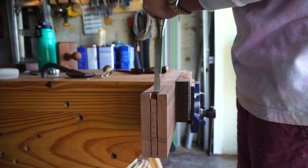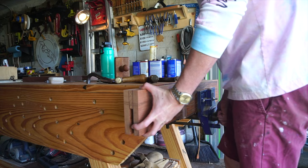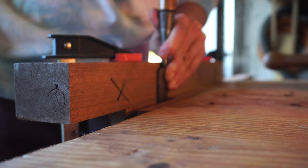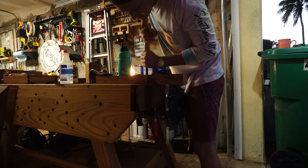To clear the waste from the mortise I'm using a half-inch mortise chisel. Mortise chisels are heftier for a multitude of reasons — namely to resist twisting and bending, with its stoutness able to hold an edge longer during more aggressive tasks. This mortise chisel is the Veritas chisel in PMV-11 steel, which holds an edge well and sharpens easily. I'll start from one side, flip to work the other, and then knock out the middle before trimming with a bench chisel to final dimension. Using squared stock as a reference fence is a great way to ensure components are flat, square, and that everything seats properly.